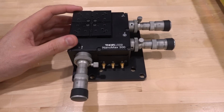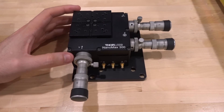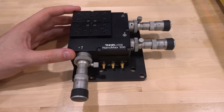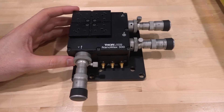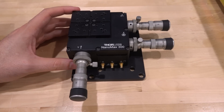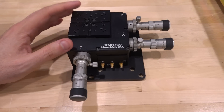The crystal sits on top of some mechanical gearing, and together they sum all the movements to position the plate at the top. Piezoelectric crystals are a subject worth a whole video — by applying charge to them you can change their dimensions, warp them, or change their length. Conversely, if you apply mechanical pressure and change their shape by force, they generate charge or electricity. This is due to interactions between electric charge and the crystalline structure. Because of this phenomenon you can make speakers, spark generators, actuators, and motors.